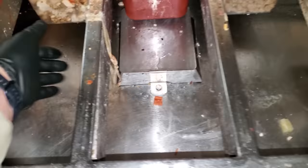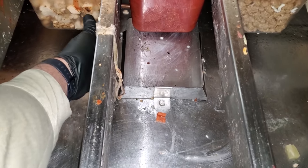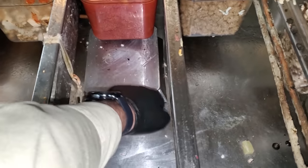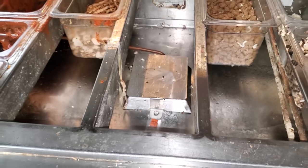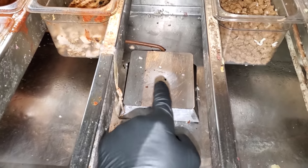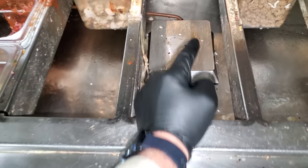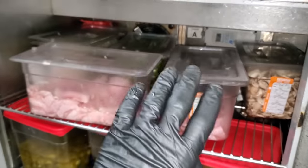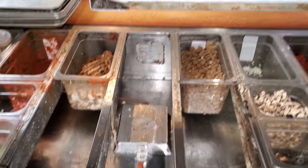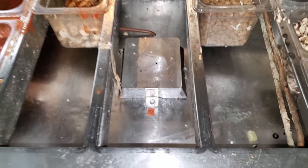The complaint is it's not temping. The first thing on these is the fan motor — the fan motor is not running. I need to open this up and investigate why. Oftentimes it's a giant block of ice, so we'll get into it and see. Understanding how this unit works, we should have 115 volts supplied to that fan at all times — it never shuts off, even in defrost. The power is the same source that powers the bottom, so my bottom fan motor is running. Pretty good odds we have power to that fan motor. I'm going to get a 7/16 nut driver and pull that guard off.